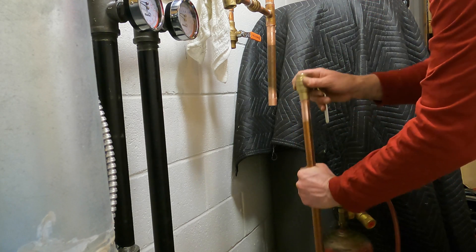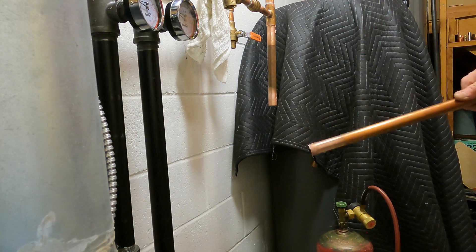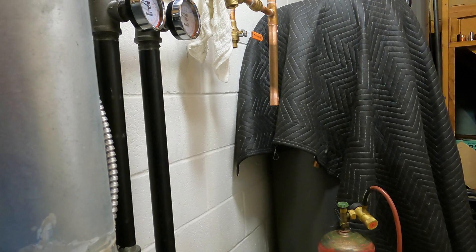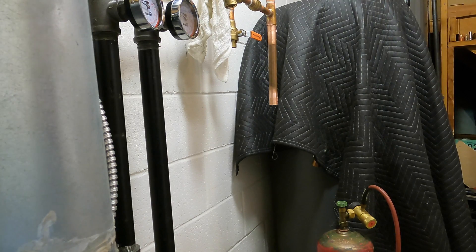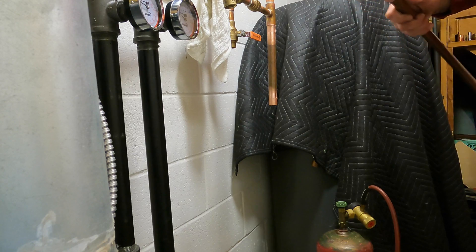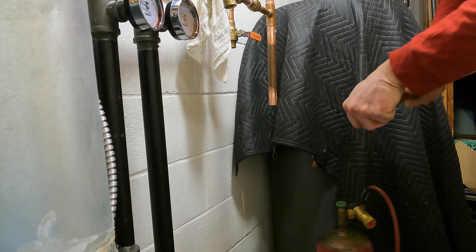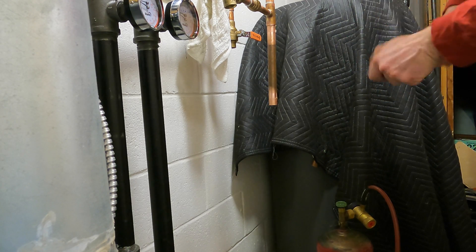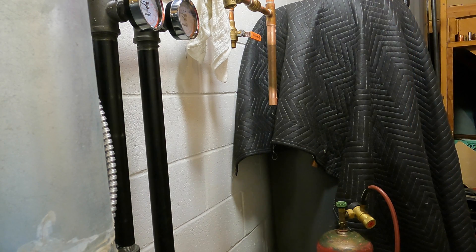Wait — here's a major step: you've got to always ream the copper. Don't skip that process because it actually creates water turbulence. I doubt this one little fitting would be the end of the world, but I just don't like to cut corners. I do it on gas pipe and copper alike. Make sure the little burrs are out from the inside.